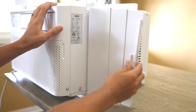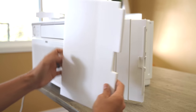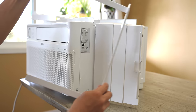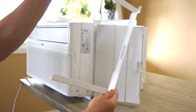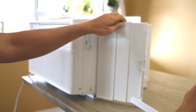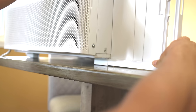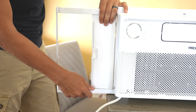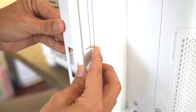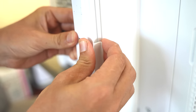The accordions on this unit are actually plastic — like little paneling, which is pretty nice. After the window air conditioner is in place, you put those pieces of insulation into them to seal up those little panels. Putting on the accordion brackets is pretty easy; most of them just slide on. You just have to make sure the screw holes where you mount it are towards the inside of the house, not the outside. The accordions have little clips at the ends that clip right into the bracket, so that when you slide it, it slides in and out with the bracket.